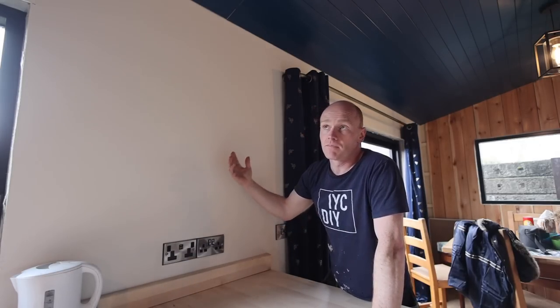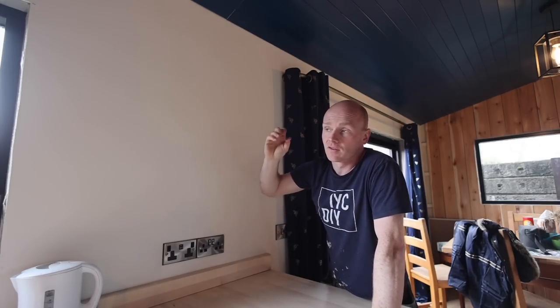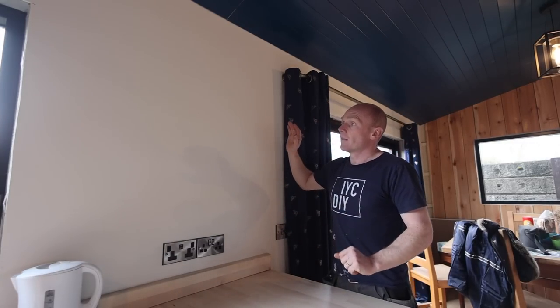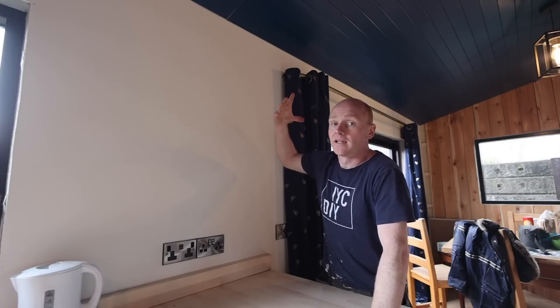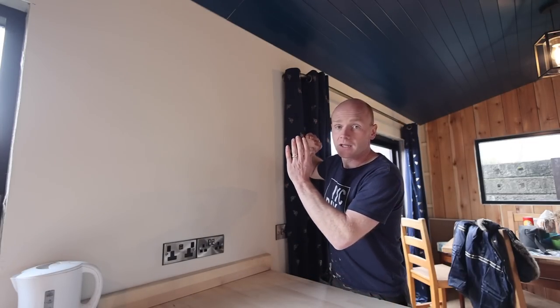Another option some people use is blowing air into the house - bringing in fresh filtered air from your loft, and if you've got a leaky house the stale air goes out. But it's very uncontrolled because you're relying on leaks. We've done this build in a way that hopefully there aren't too many leaks. So we want a fan that takes out the stale warm air without losing the heat. It brings in fresh air and preheats it using the heat that would otherwise be wasted.